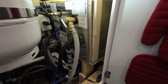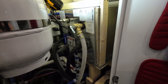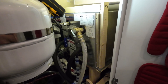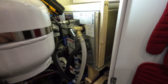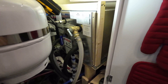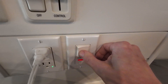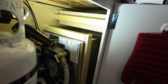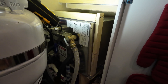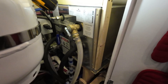Here you can see I've got the water heater installed where it's going to go in my van build. This is a six-gallon water heater, and you can heat the water in one of two ways. You can use the 120-volt 1,500-watt heating element — you'll need an inverter or shore power for that — and just flip a switch labeled 'water heater' to turn the electric element on and off. Once it reaches temperature, around 120 degrees, the electric element will turn off. The other way to power the water heater is with engine coolant.